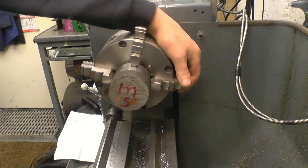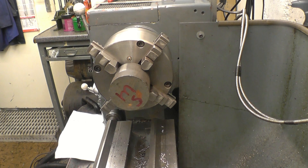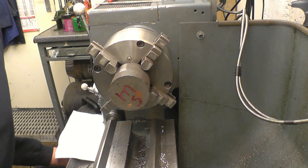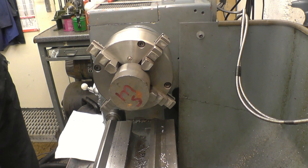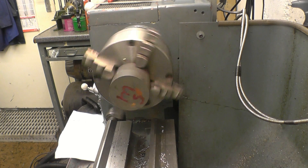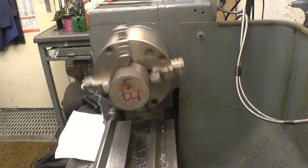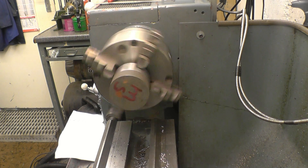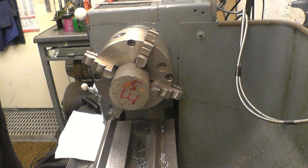It's got MS on it — MS stands for mild steel. Always start the lathe off with a warm-up. From cold, it just means that the oil gets around the headstock bearings before you really start to turn the revs up on it. It certainly can't do any harm — it's a bit like the notion of warming up a car engine from cold.